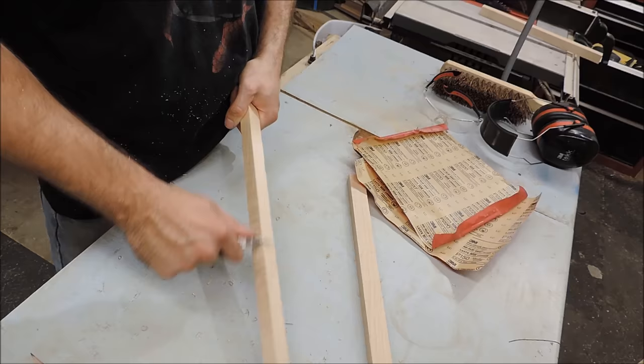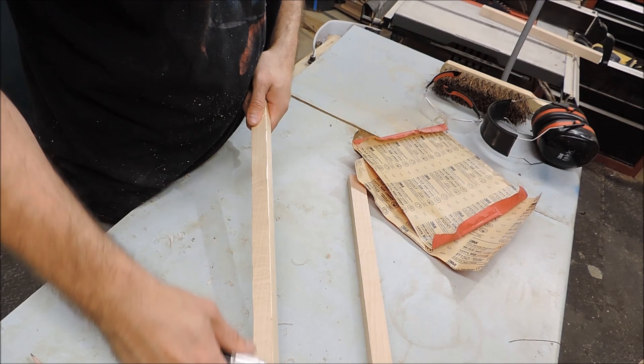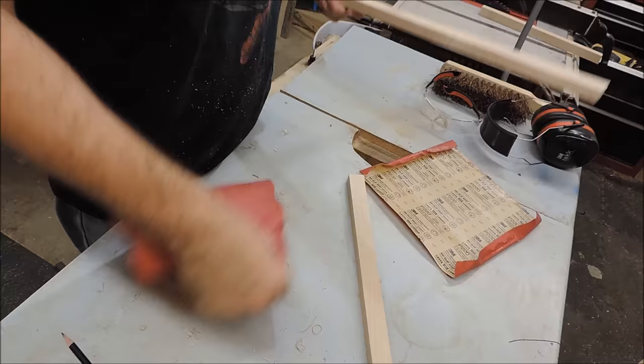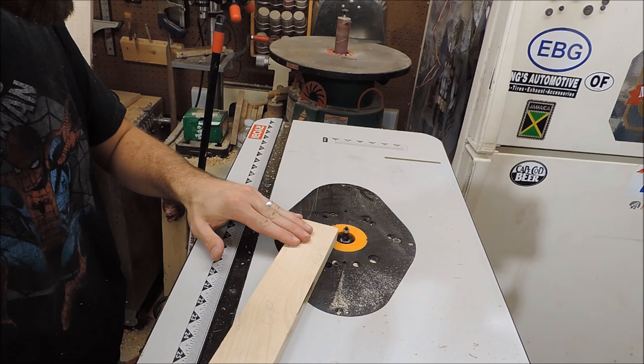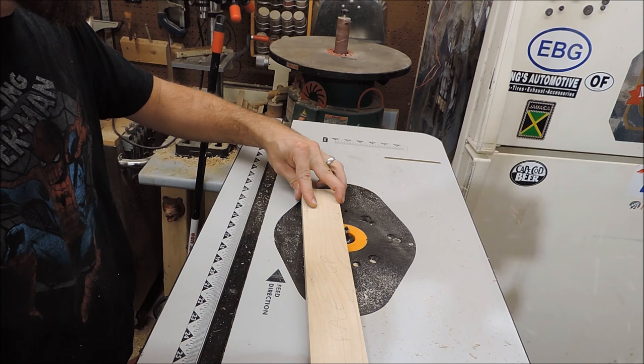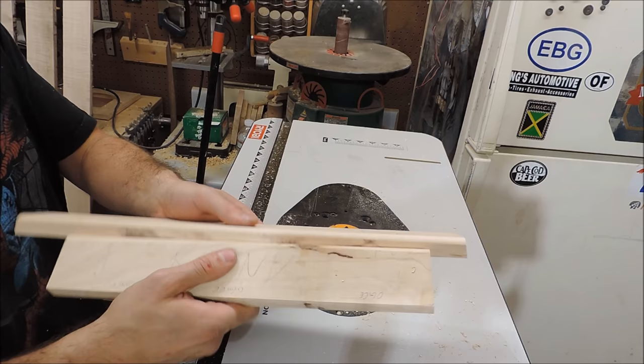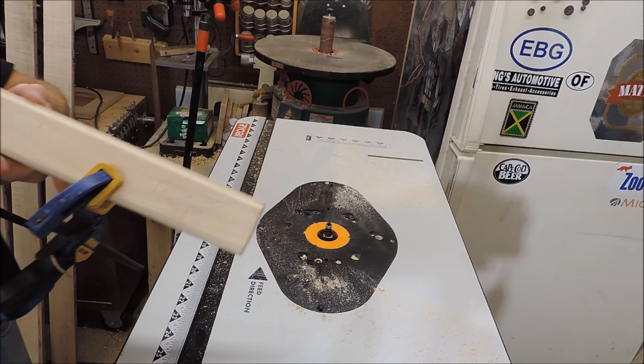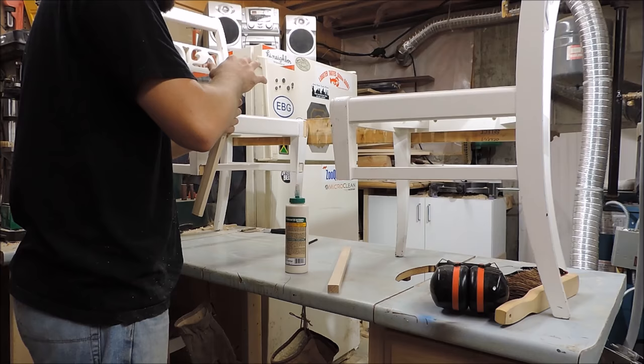For consistency in the design of the bench, I want the added pieces of wood to match their original counterparts. Stretchers are the narrow strips of wood that reinforce the chair partway down the legs, and I start with those. On these chairs they're shaped simply with rounded edges, so I'm doing the work by hand. The apron of the chair, which is where the seat attaches, has a slightly more complex design. I use a router to achieve a large round on the bottom edge, and then flip the piece to apply a Dupont profile — essentially a rounded edge with a decorative step.